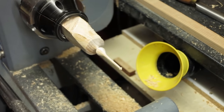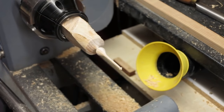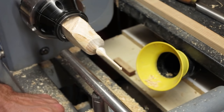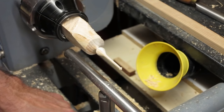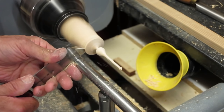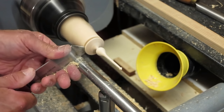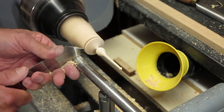So that's the very basic finial. People will say, and quite rightly so, it's a bit thick at the top — but this is not about design, this is how to get started doing a finial. Then what I like to do is take my thin parting tool and find where the foot is going to be parted off. Go down to as far as you want the tenon to be — the base — and undercut slightly, as you would on the base of a goblet.